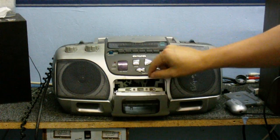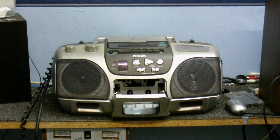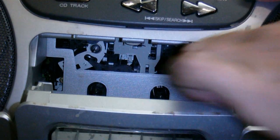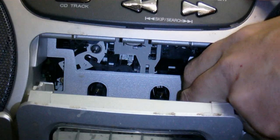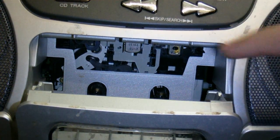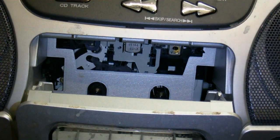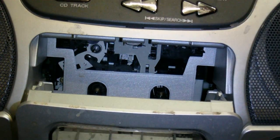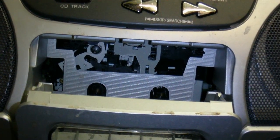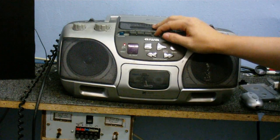Anyway, this does have full auto stop. It does not have one of those little tension sensors in it. Let's get this into record mode. You can see it has a permanent magnet erase, which is never a very good sign — that means it could have DC bias. Of course, it might be a nice surprise; you may find out that this is AC bias after all, but I'm not holding my hopes up.